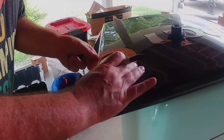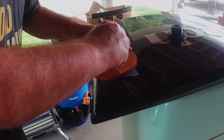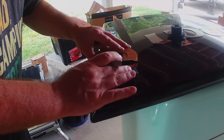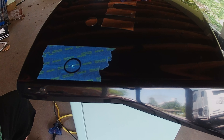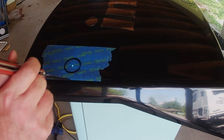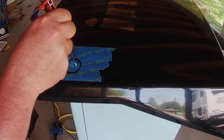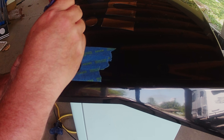We'll be using a Dremel today with diamond grinding bits — I feel they don't clog up as quickly as the sandpaper bits. It's a bit of overkill for plastic, but is it really? Scribe the circle for the hole centered on the hole punched in the tape. After you've marked both sides, this is your last chance to quadruple-check. Measure the two circles from the top and sides of the cover to see if they are close to each other. Last chance — did you check?